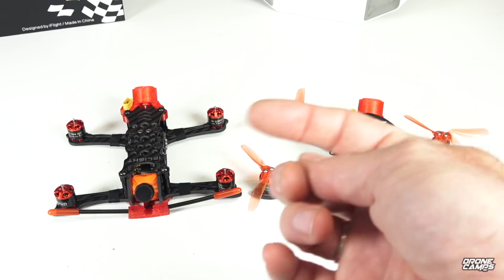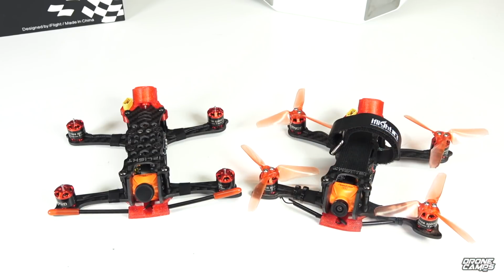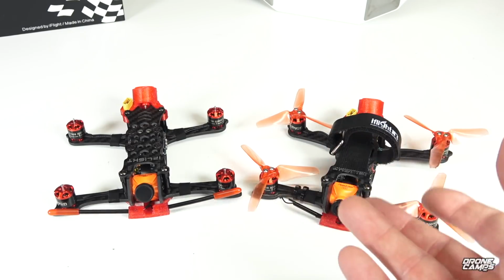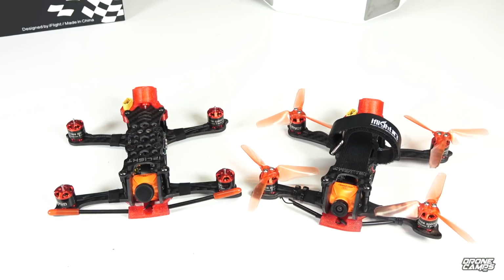Now, one thing I noticed was that some stuff came up smack in the middle of the screen, so you would have to go in and move some of those things around, but you can turn on or off just about everything inside the OSD, which is really, really cool. And GPS is in there, all types of different GPS settings, your PID profiles, rates, and your channels and bands and VTX power, all that stuff like you'd normally have. The craft name is all inside those menus, and it's super easy to access or change things on the fly, which I was able to do within a matter of 30 seconds, just going in the menus, flipping over to increase the VTX power to 200 so I could fly out a little further over the ocean for you guys. No big problems there at all.